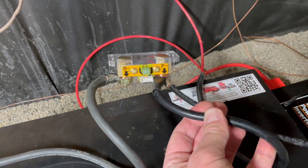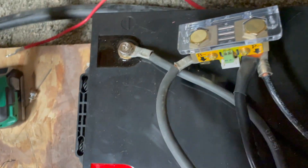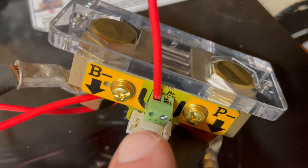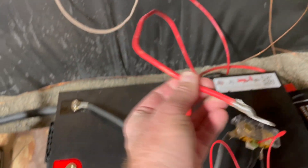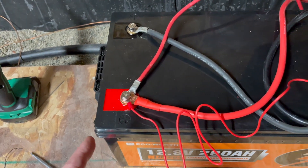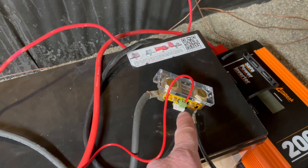Next it's time to give power to our display. The wires for the display are going to be coming out of here and up into our upper room, but in order to get power we have to connect the red wire over to the positive terminal on the battery. This little connector goes into the B slots on top — thankfully the company included a little screwdriver that's perfect for this screw. Next we take the positive side from the inverter as well as the positive side from the charge controller and slip them onto the same bolt into the positive terminal. Be very careful here — there's actually a spark, a little bit of discharge that happens when you touch the positive to these batteries, so use a lot of caution. Now the charge controller has power, the positive side of the inverter has power, and the shunt has power.